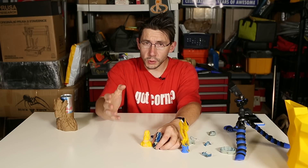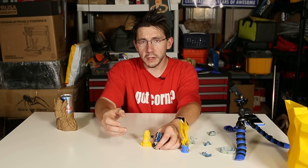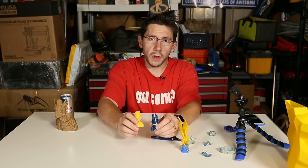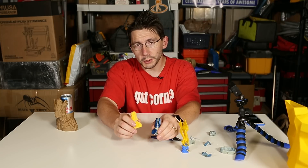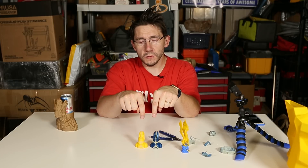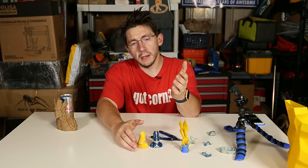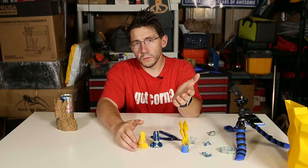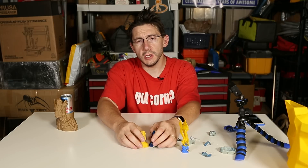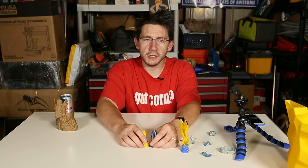Dual extrusion printing is going to be the next big thing in low cost 3D printers — well, hassle-free dual extrusion — and he makes a very good point there. The reason we have an ooze shield is because dual extrusion printing is definitely not hassle free at this time. When you have the two nozzles together and you're dealing with different filaments and different types of materials, you might set one heater to one temperature and the other to a higher or lower temperature, and then you're dealing with retraction issues and oozing more or less. It could just be a headache.